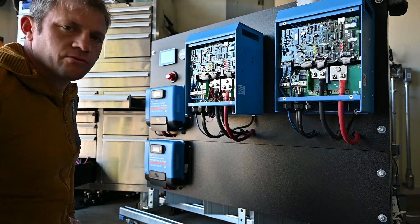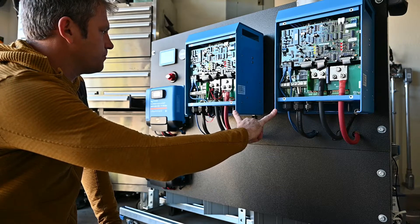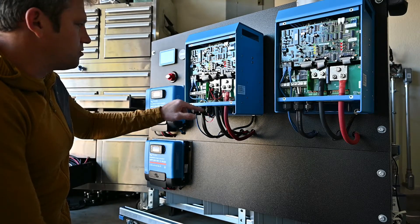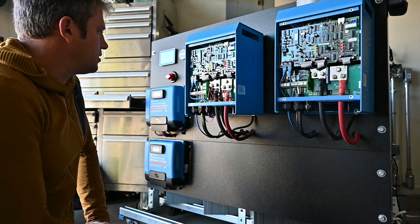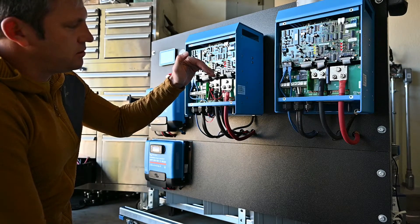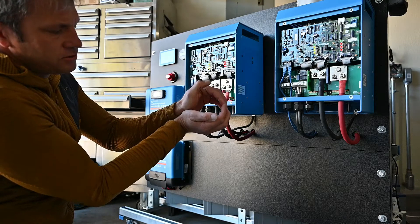One of the questions was: what does the AC wiring look like for split-phase 240? There are two Multi-Plus 3000 inverters here, roughly capable of around 4.5 kilowatts of charging. The two are linked together via this ethernet cable. You do some settings inside the device with an ethernet cable and your computer. Essentially you can take one of the half sine waves of one inverter and sync them so they're 180 degrees out of phase with the other inverter. The delta between the two is going to be your 240-volt RMS.